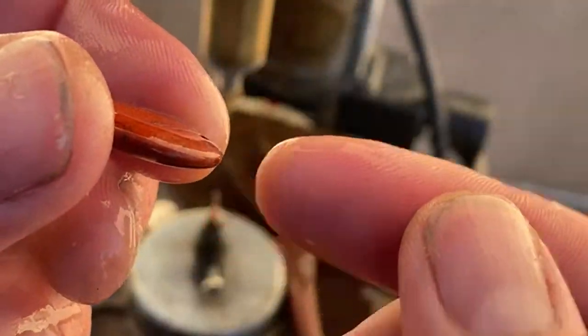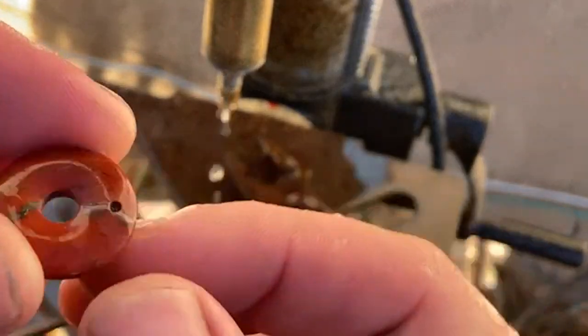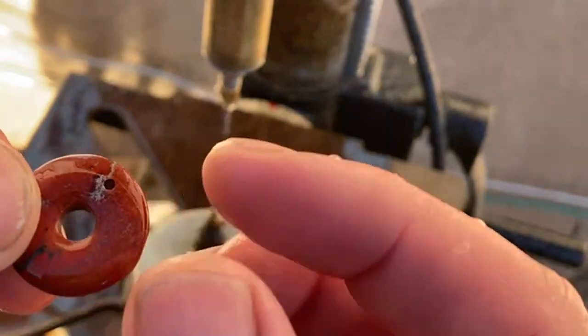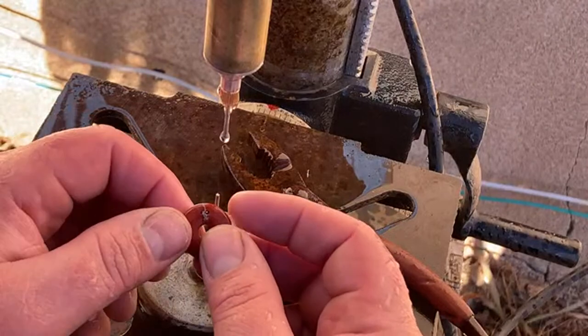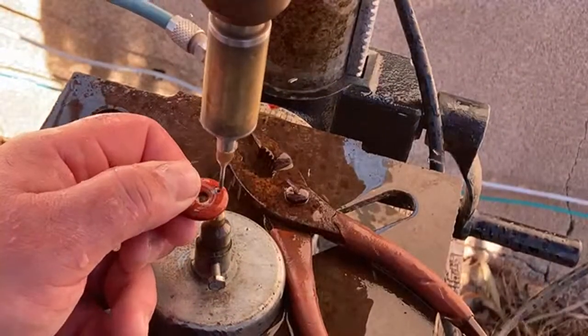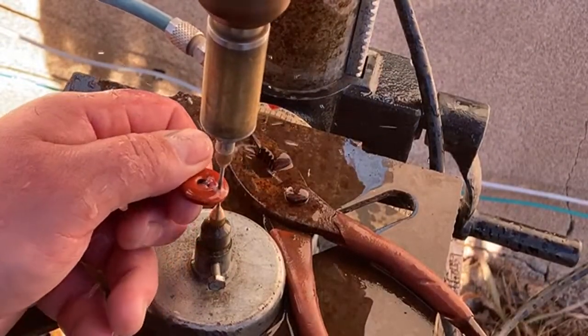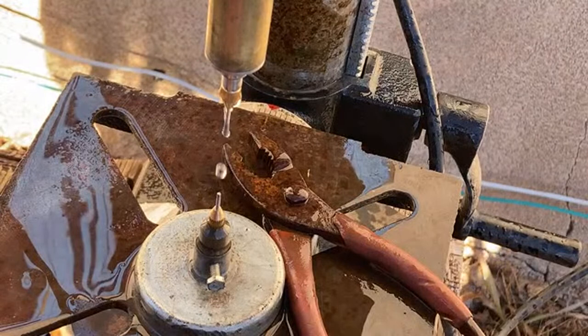Here's another tip. Since this is sloped, it's kind of pulling the burr down and it's bending a bit when it's drilling. That'll usually happen after you've started your counterpart hole. Get enough of the hole through to put it back on the counterpart and then drill it through the same side you started with, because now you already have a pilot hole.